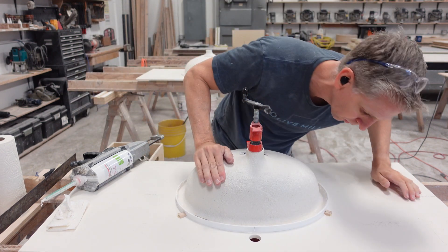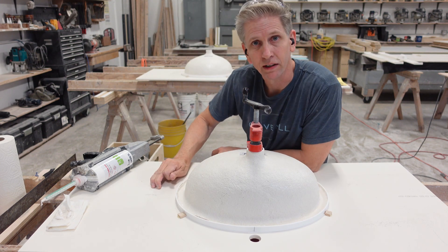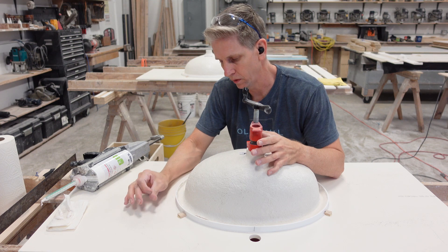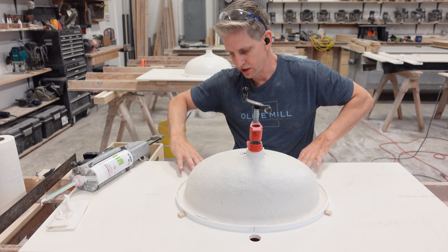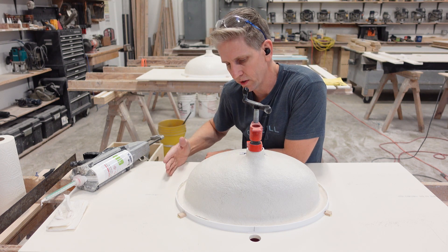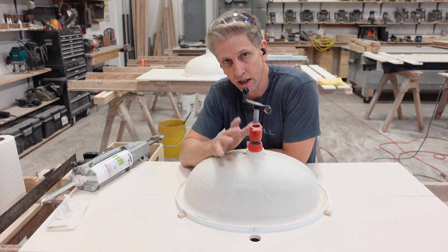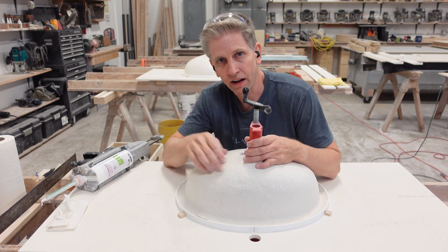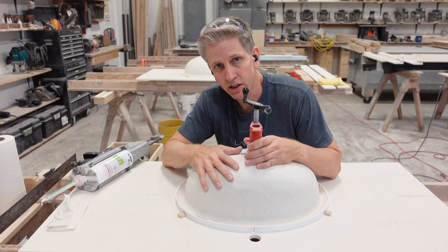The glue is squeezing out all the way around. That's all there is to it. There are other ways to mount a sink, but this is a pretty easy, straightforward way. Some other options: you can put weight on it, or use clamps that reach in at four corners. But really the most important thing is getting the position square to the front of the sink — the center line marking is extremely important. If it gets crooked, it looks really bad and it doesn't take much to get it out of square. There are some other videos of me trimming these sinks, so look for those. Appreciate you watching — see you next time.